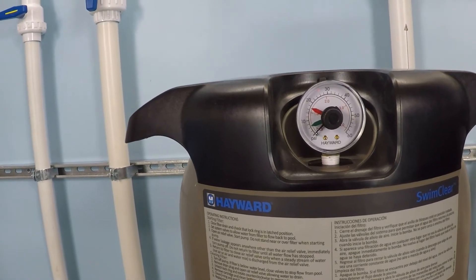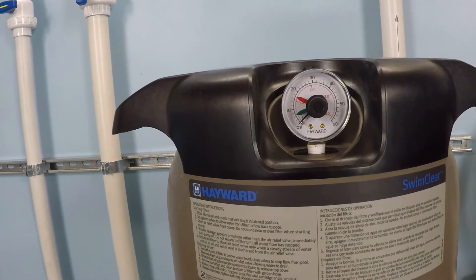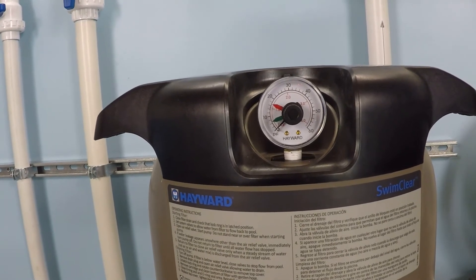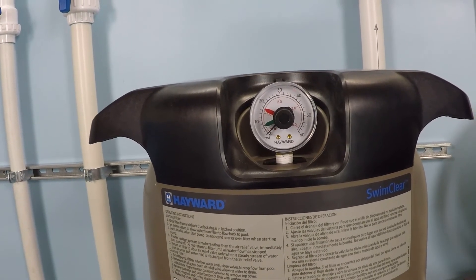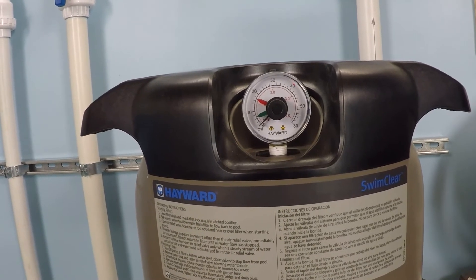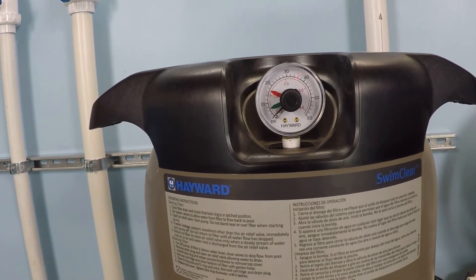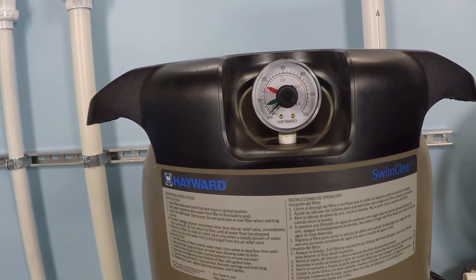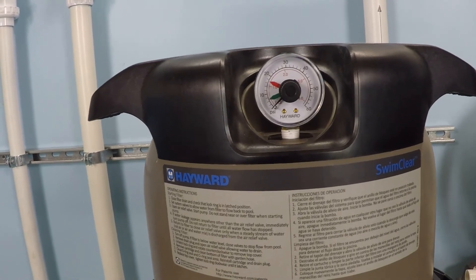When you see the green and red arrows on this filter gauge here, that indicates clean operational pressure, and that's something you would set at your maximum RPM values. It's not something you have to worry about when running at lower speeds — you don't have a lot of resistance to flow, and that's why there's not a lot of pressure building on the pressure side of your pump system.